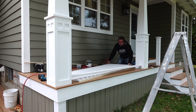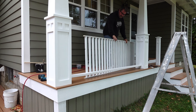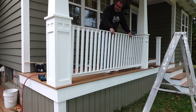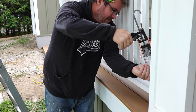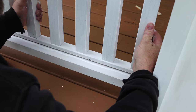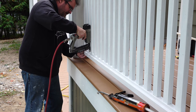I did the same on the top, then lifted the assembly into place between the posts. Before attaching the bottom, I ran a bead of caulking — that will help to glue the strip to the rail and keep water out. I used a few nails to secure it down to the bottom rail and then ran another bead of caulking on the outside seam.